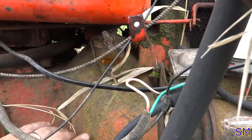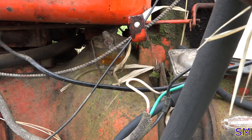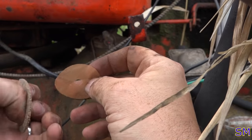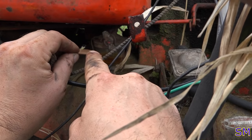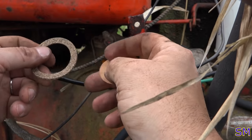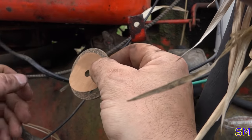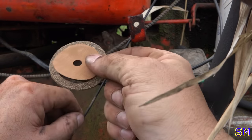Fantastic. This is our fuel bowl right here. I'm gonna take the glass off. And what I have, these guys. It's a fine copper mesh screen. It'll sit right on top of here, collect the biggest chunks that come out from the fuel tank. Also got a new cork gasket, because I don't know how old that one is. Being 10 years dry, it's probably all crusted up. Just trying to prevent stuff from having any more problems so we can get this thing show on the road. So let's go ahead and drain that bowl. Let's get some new parts installed on it.